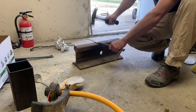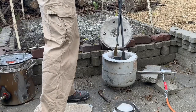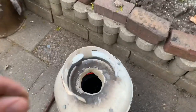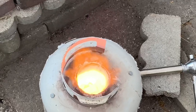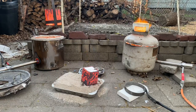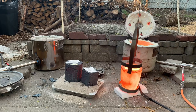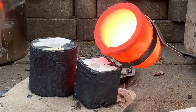For the copper, I'm just crushing some copper pipe — that's what we're going to make the coronavirus body out of. I've had lots of people give me their two cents throughout my life, and I finally found a use for it. The zinc inside the pennies acts as a flux and helps purify the copper. I've got one furnace keeping my molds hot, and the other one actually melting the copper. My favorite metal to melt is copper — the camera doesn't pick it up very well, but the color and shimmering shine of this glowing metallic liquid is just beautiful.